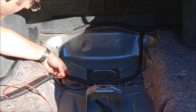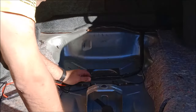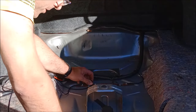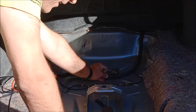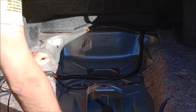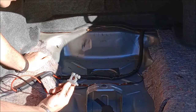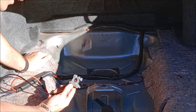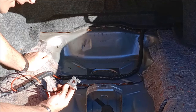This is my coax cable which I need to salvage. Now, you have two types of grounds in a communication site: a multi-point ground and a single-point ground. A multi-point ground is supposed to ground metal objects that can carry RF energy that aren't designed to — like the hood or the trunk. Then you have a single-point ground, which a manufacturer says you shall ground this equipment from a specific grounding point on the back of the radio.